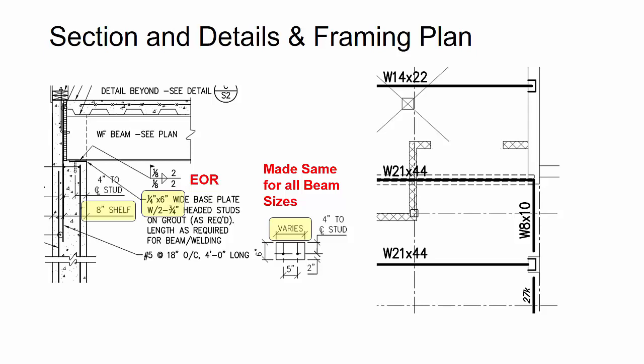So what I did is I looked at and kind of scaled on the drawings where he draws a pocket actually on the plans. And I found that it was approximately 12 inches when I scaled it. And so I made it 12 inches and asked the engineer to verify that in an RFI and on the drawings.